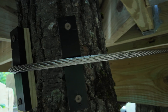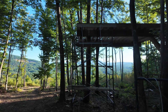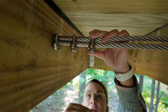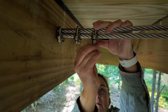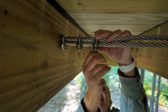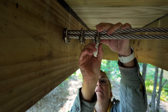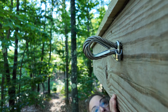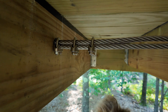Good morning. So today we're going to finish tightening up this 25-foot cable, and then I think we can start tensioning this line. If everything goes right, hopefully we can start putting the stanchions on today. We do not saddle the dead horse. I've got one out there and three in here — that's a little bit wider than a saddle. All right, let's tighten these up. Three was the minimum, so we've got four clamps — I wouldn't mind putting another three or four more on.